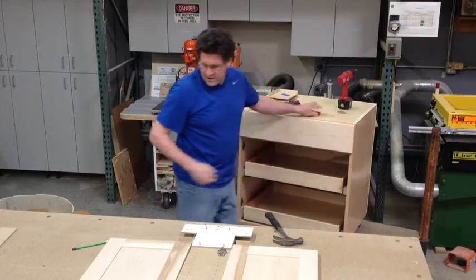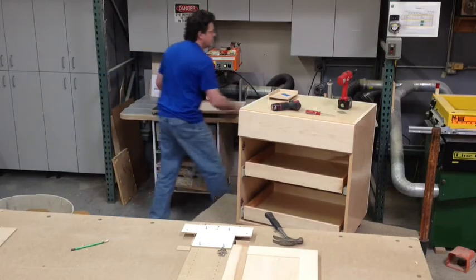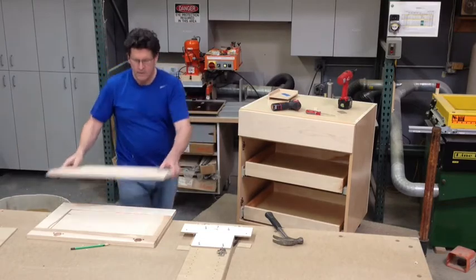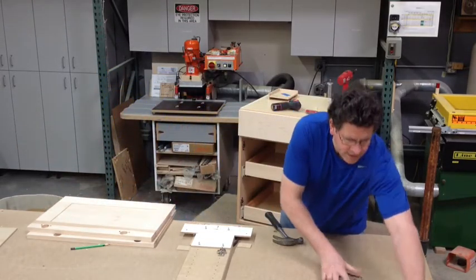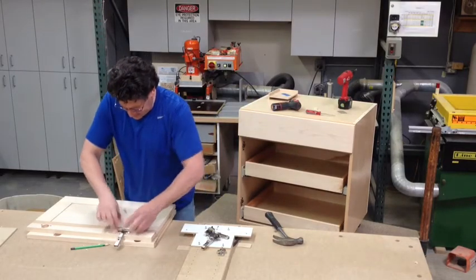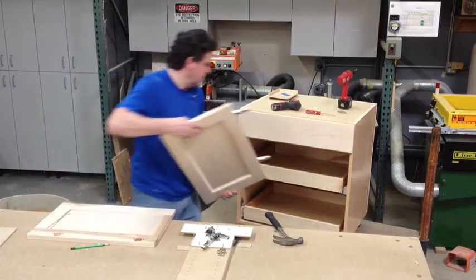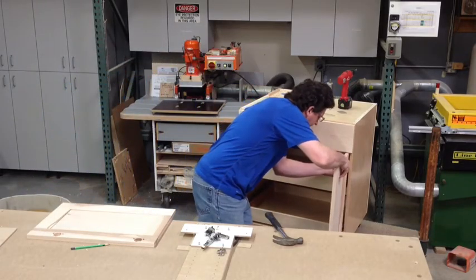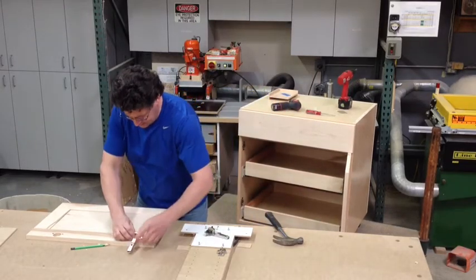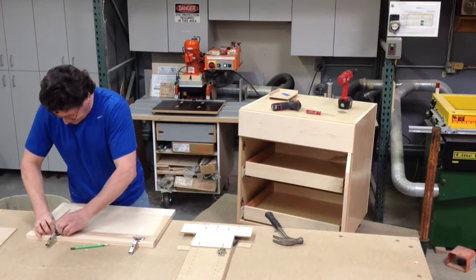And then what we're going to do is take our doors that we marked, and we're going to bore those. Dust collector. And then we used again the Blum toolless insertion hinges. Nice and easy to do. Clip this up here. The other one here. And then when I'm done, I'll show you a close-up of the actual templates.